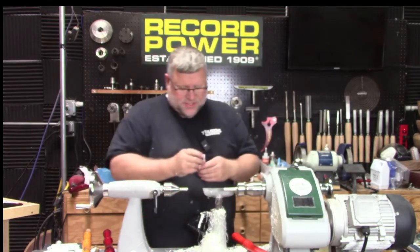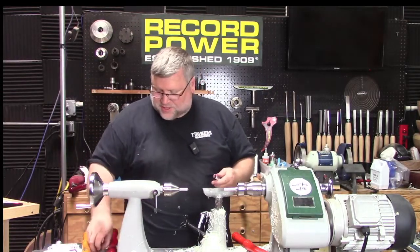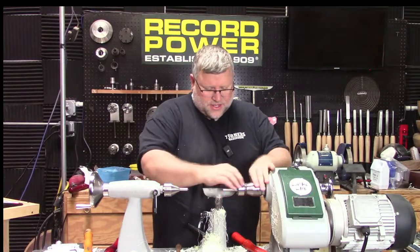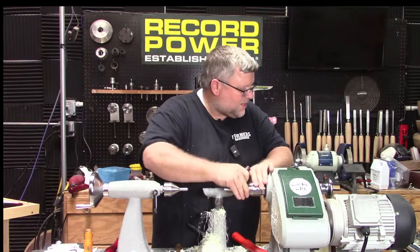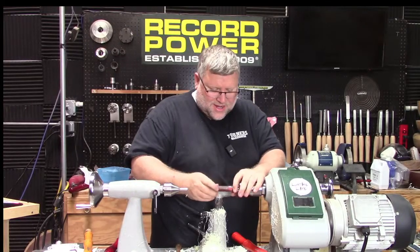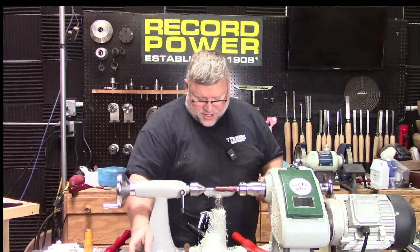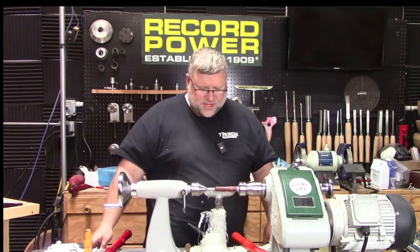again, this is an M13 that we did last week. Boy, it's really dirty. M13, we're doing an M10 inside for the section. And what else? I drilled a 9mm hole for the body for the M10. Now, again, this is an old aluminum mandrel. I would not recommend aluminum. I need to make some new ones. We are going to make some on a live stream. So maybe we can make some out of Delrin or something.